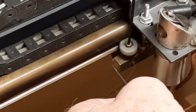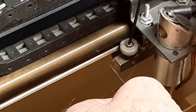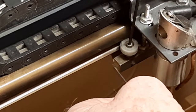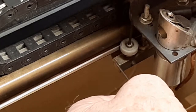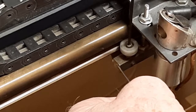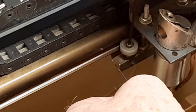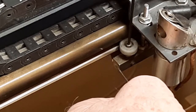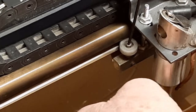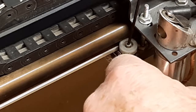What you want is that carriage to have as little slop in it as possible. You don't want it to pinch, but you want it snug. It shouldn't be able to move much at all. And you saw how much movement I had — when I turn that wheel just a little bit, all of that movement is sucked up. So I'm going to leave it right there for now and give it a run.